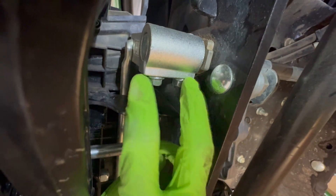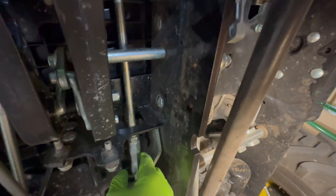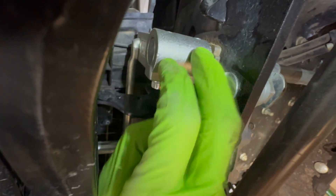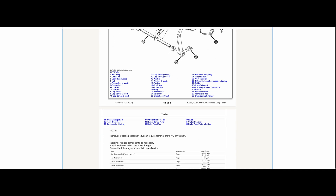When you're pulling these bolts off, we've already tensioned this rod, and for any tension in the opposite direction you can grab onto this linkage and just push forwards to alleviate the tension for these two bolts — both out and in. For my model of 2019, both the pedal and the bell crank cap screws come in at 15 to 22 foot-pounds as their torque rating.